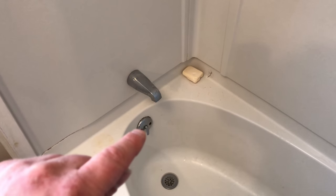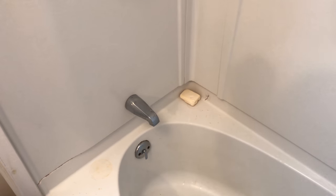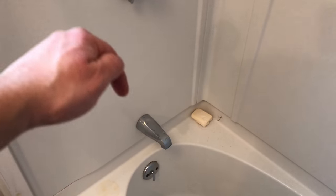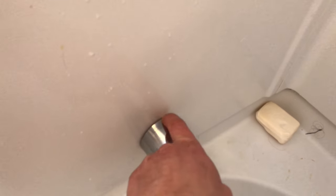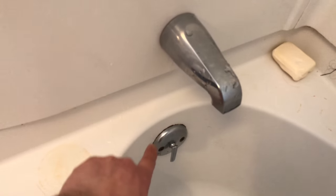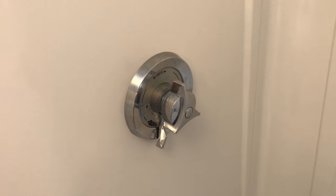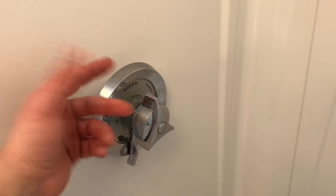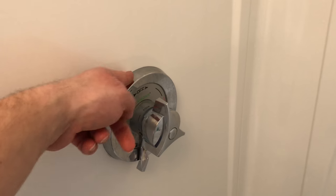The drain stopper right there is actually where it's leaking from. Common areas to leak are where the water is coming out. If you don't silicone right here, water can get behind this faucet — there's a little crack right there. So what I'm going to do is silicone here and put some clear silicone around the drain to seal that off. And while we're at it, we'll run a thin bead around the trim piece on the shower control, and that'll help seal out any water that might be getting behind there as well.